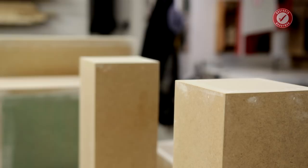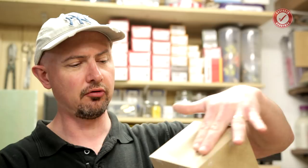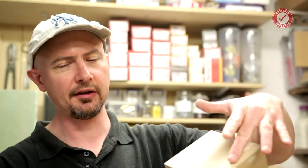My golden rule with all of this: if you can feel any bumps in the surface at all, you'll see them. This surface now feels totally 100% smooth — I cannot feel any difference between the edge grain and the face grain of the MDF. The whole purpose of this stage is literally just to fill any holes, get it ready for paint, and make sure it feels perfectly smooth. Come back in part three and I'll show you how I paint it.